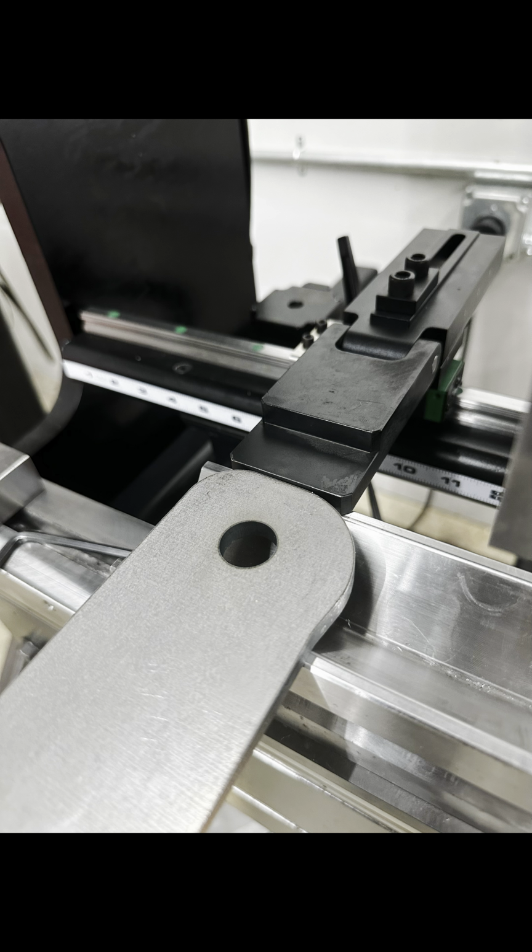My solution was to draw one up in SolidWorks and get ones custom made. Dimensionally, I kept it the same as the original, just without the angle. One of my goals was that I wanted to easily swap them back and forth if needed without having to recalibrate. In addition, they work well for parts that have a small reference face because I now have a flat face like I do with the upper face.